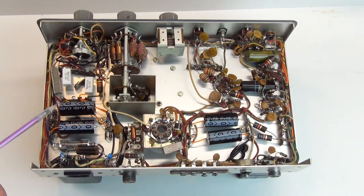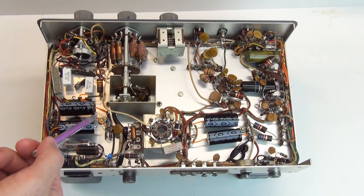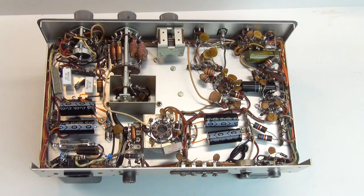On the negative end it isn't practical because there's an exposed metal cap there that you can't do much about anyway. Moving on to the DC side of the circuit, I've replaced all four filter caps, and hidden behind this component down in this area are the two 1N4007 rectifier diodes with some orange Teflon tubing for a bit of extra insulation. One final comment: when installing axial lead caps, I like to follow a best practice and put a little bend or kink or arch in the cap. The reason being, if they're straight, thermal expansion and contraction might put tensile forces on the lead and possibly pull it out of the cap. Putting a little bend in there so there's some compliance in the lead is thought to be a good idea, and it's easy and quick to do.